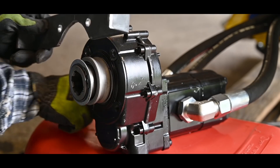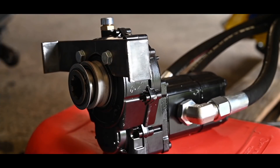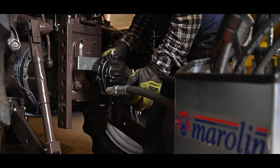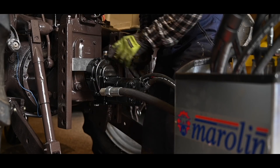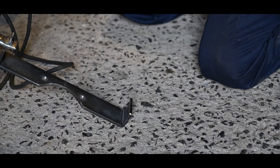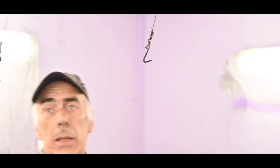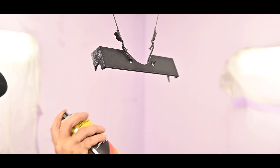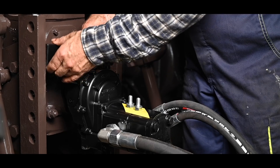Let's see if the bracket fits before we start welding anything. I'm going to mount it on the pump and then put the pump on the tractor — not locking it down too hard, just a trial fit. And that seems to fit very well — it's kind of flush. Now I need to make holes on the side to put big bolts through, and I'll reinforce the corners by welding them up. Then we're going to give it a little paint because we don't want it to go rusty.